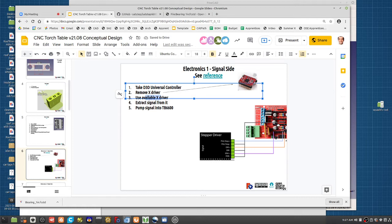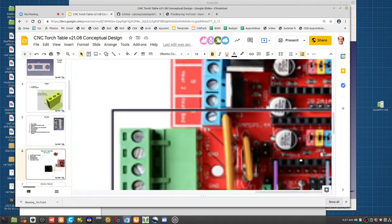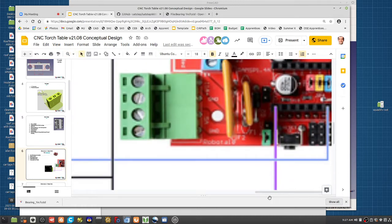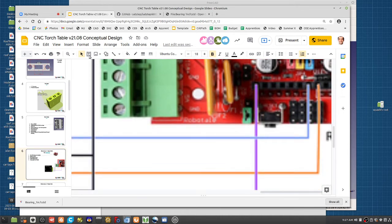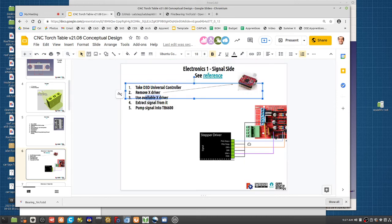So now you have signal. You put little leads, like for example phone wire, that's Cat5 solid core cable, or just any jumpers, into the corresponding holes. Just look at this picture here, on the first stepper driver. This upper right most pin, but that's how it works. You can follow this diagram, and it's basically three signals and then one ground. The black here is ground. On a stepper driver you've got the labels like pulse, direction, and enable. So you need three wires.